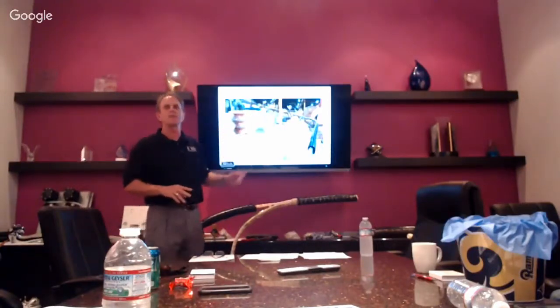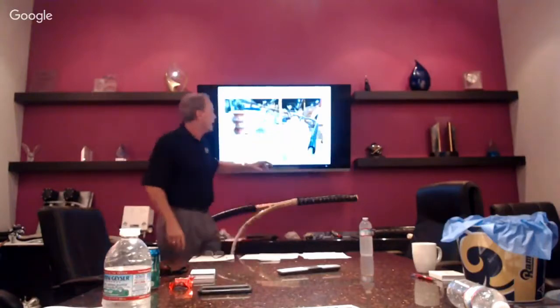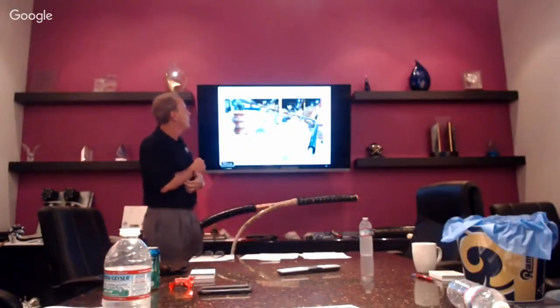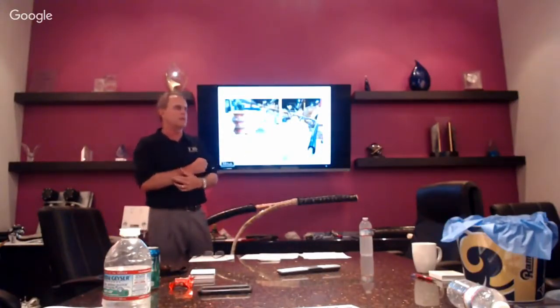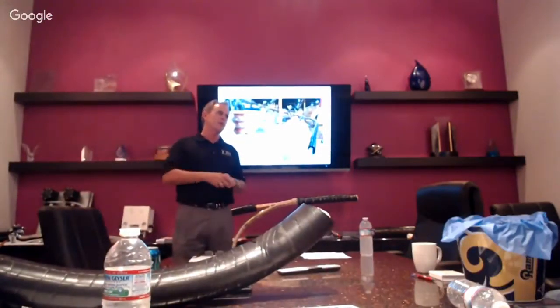One of the things that they have to do is because we do branches in our line. So if we got 2 6-faucet towers and you just want to use one conduit, we'll run a 12-line bundle with a branch. And you actually can run it backwards. Six go here, and then the branch, the other 6 go to this one, and then the 12 goes back to the walk-in. Those branches are made at the factory, and we give them the dimensions so they put the branches where they're supposed to be.